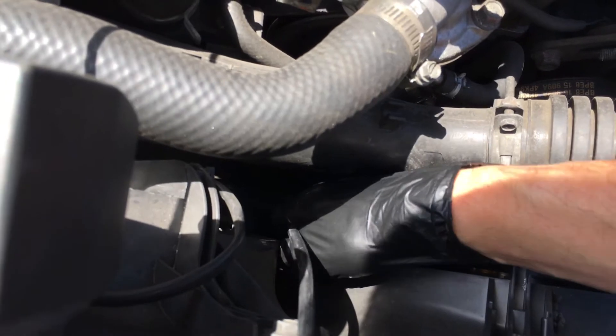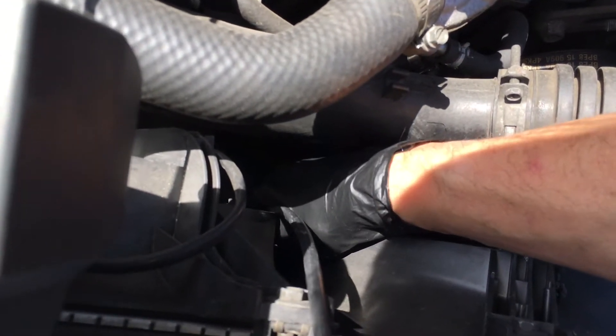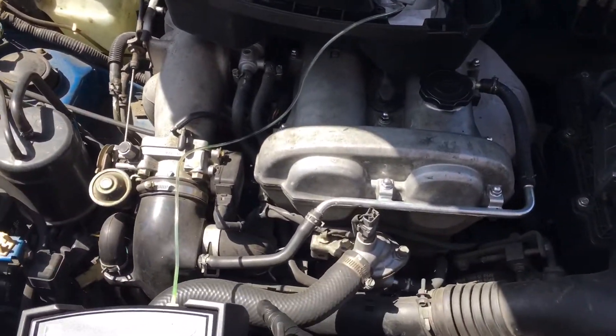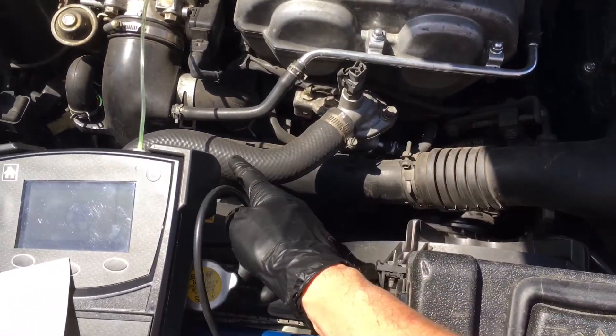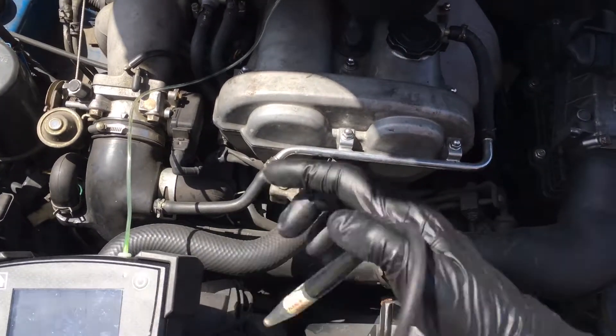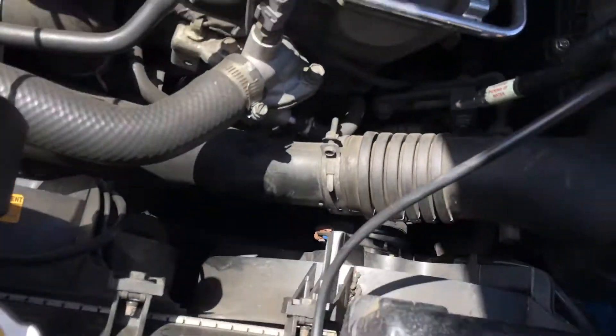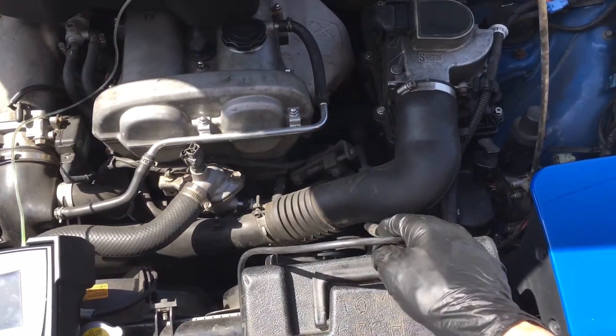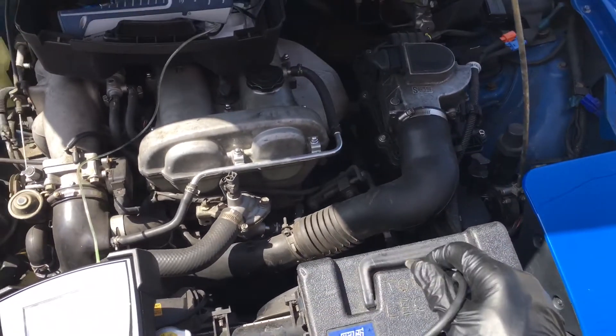When I come down to this rubber hose that is down here, refrigerant is seeping right through the surface of the rubber hose. There are no oil leaks but the refrigerant is just seeping right through. Then we have the front shaft seal right off the clutch — there it goes — and there's oil accumulation around the clutch.